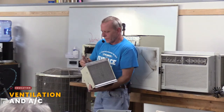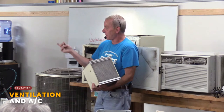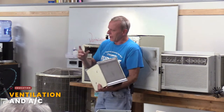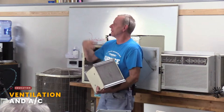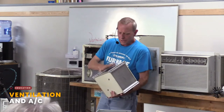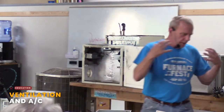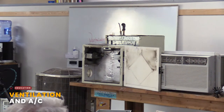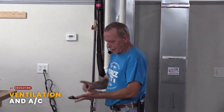The air never mixes, but there's a product in here that makes that heat transfer I was talking about, hot to cold, happen. So it tempers that air a little bit. Let's say it's 2 degrees outside. You're not bringing in 2 degree air. You might be bringing in 40 degree air, right? And vice versa, you're not dumping your hot air or cold air outside, right? So that air goes through, transfers that heat back and forth, bringing that fresh air in and expelling that stale air out. A lot of times it's dumped into the return of the home, of the furnace system, and then it's run through and either heated up or cooled down.